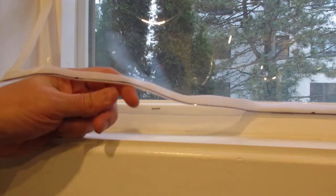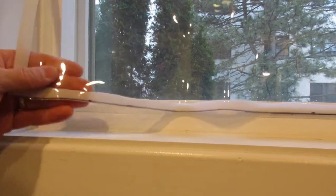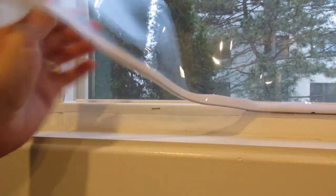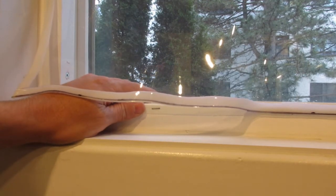There's a couple of terms you want to familiarize yourself with. One is the R value, and the other is the U value. Depending on the type of windows you have, putting something like this over your window can save you a bunch of money on heating costs over the winter, because it will increase both your R value, because of the space we create in the window, and the U value, which will decrease the amount of air that can penetrate out from the gaps through the frame.